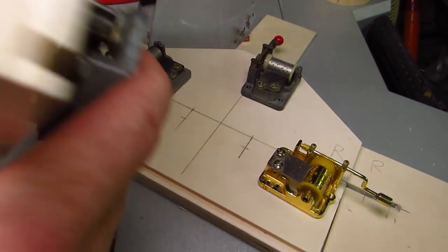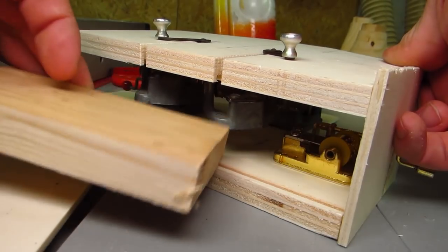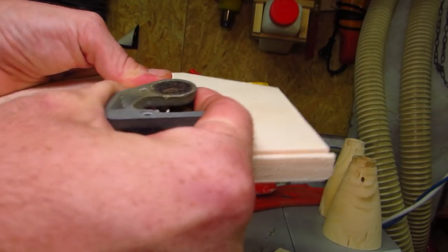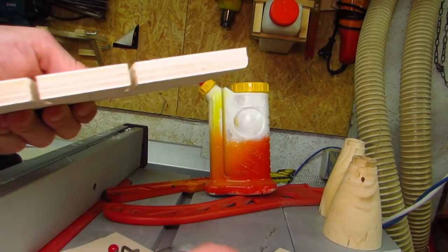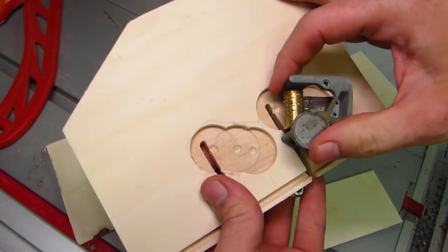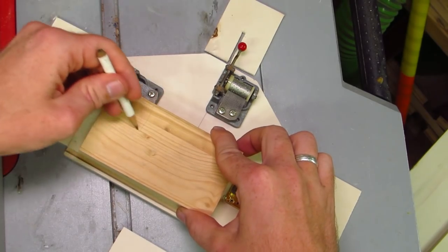There's a problem with the two top cranks though — the material is too thick for the clearance of the crankshaft. Also, I need to raise them up in order to screw them down. The latter problem I should be able to solve with this blocker wood. The former requires that I sketch where the mechanism body touches wood, then use a forstner bit to remove material there. A series of three holes each is enough to make it work. As it turns out, these cranks can interfere, but only if you really want them to. I cut the riser to fit and glue it in place.